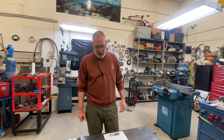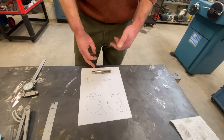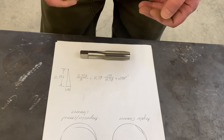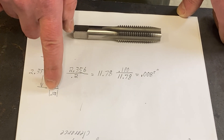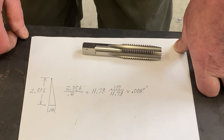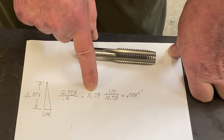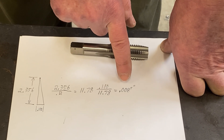From what I understand, we want the axial relief to match the pitch. Our example here is a 3/4-10 tap, so in one revolution it's going to advance 0.1 of an inch. I've multiplied that by pi, which gives me the circumference of the tap itself, and we know that over the course of this circumference there's going to be 0.1 inch advancement in pitch. I've measured across the teeth and I'm getting really close to 0.2 of an inch. So I take the circumference divided by 0.2, which gives me a ratio, then take the pitch of 0.1 divided by that ratio, and that gives me 0.0085 inches — that's the clearance I want to see over the distance that these teeth exist.